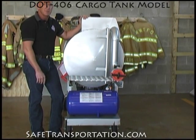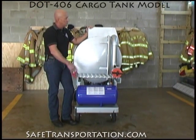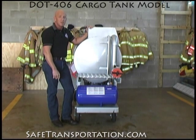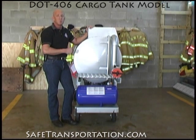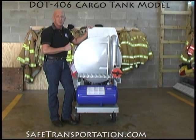It is also how the valves are operated. This pneumatic tank would duplicate what you would find on a normal DOT 406 cargo tank in the fact that they use air pressure in a lot of cases to operate their internal valves, and that air pressure comes from the air brake reservoir between the rear tandems on the cargo tank.